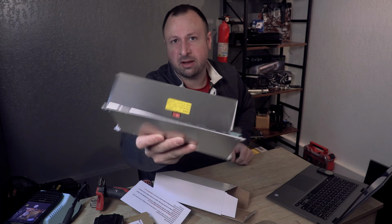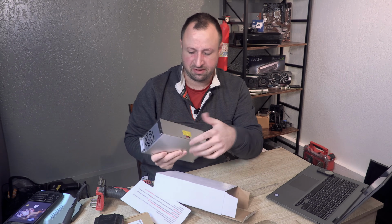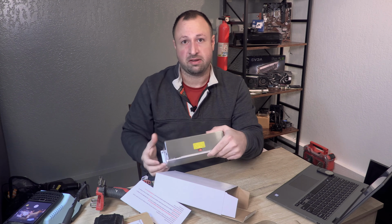If we look there, that's standard, like old ATX power supplies have this. If it's over this side, it's at 120 volt. If it's at the other, it's 240. It just bypasses some electronics in here that step it down.